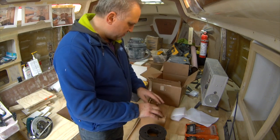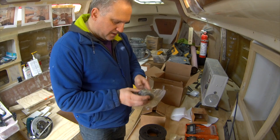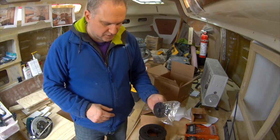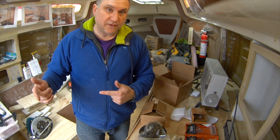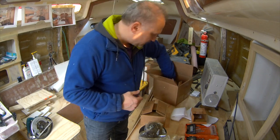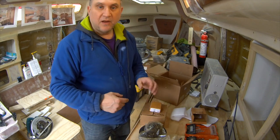I'm going to check how the gears fit — this one will go on the motor shaft, and this one here will go on the prop shaft. I'm not 100% certain if this is going to align, but I can't move the prop shaft. I can move the motor backwards or forwards to fit things depending on what I need, so today I want to figure out how to get this thing aligned properly since there are a couple of gears with a belt going in between.